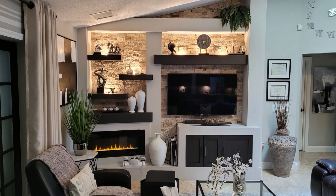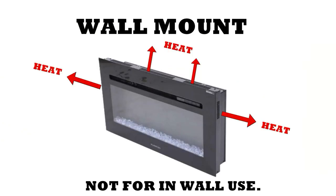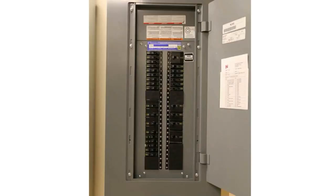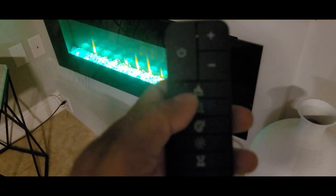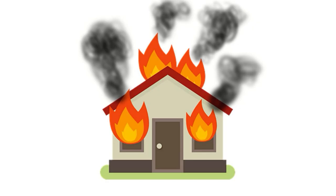Here's the finished product. One very important thing to mention: this is an electric LED wall mount fireplace, and it is not meant to be installed inside a wall the way you see it here. When shopping for one, pay attention to this feature: a wall insert fireplace blows heat out the front, while a wall mount fireplace blows heat out the sides. Each uses a lot of electricity and some require their own circuit breaker. I didn't want to run a new breaker and wire to the panel, so I opened up the fireplace and disconnected the blower and the heating element — only the LED lights work on it now. If you want an in-wall fireplace and aren't comfortable doing that modification, get a wall insert type. Do not install a wall mount electric fireplace inside a wall — you can burn your house down.